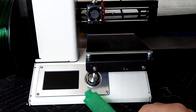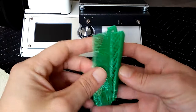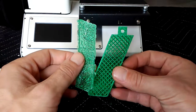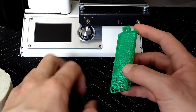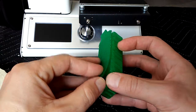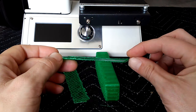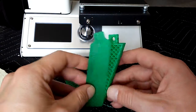I just wanted to share this because I hope other people can learn from my mistakes. It's funny how emotionally connected you get to the stuff you print — when I started peeling this off, my heart just sank. This was like a two and a half hour print. I've also had problems with the raft sticking to the build in a couple places, which is another great reason to have a thicker shell. I currently have a 0.4mm distance with 0.2 overlap and I'm not exactly sure how those distances work practically.